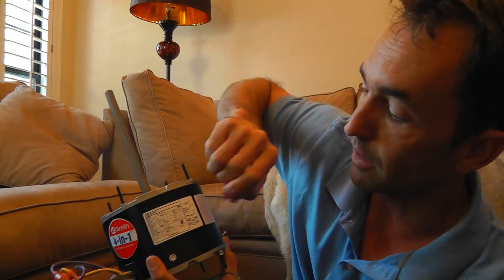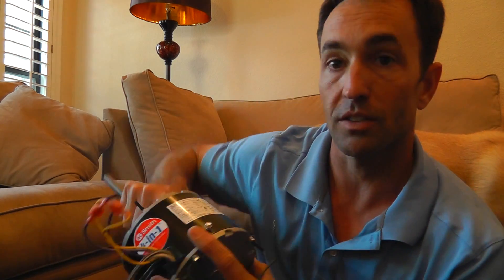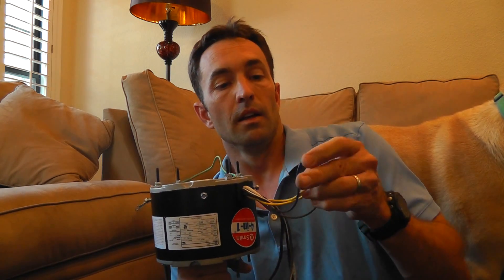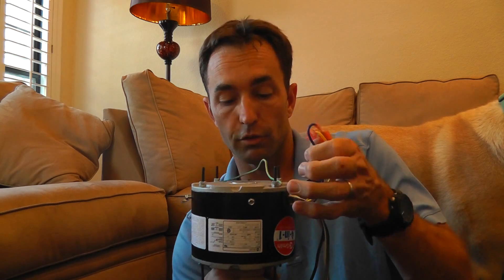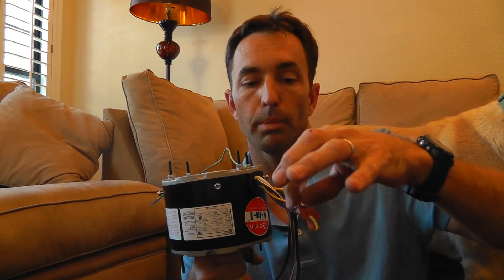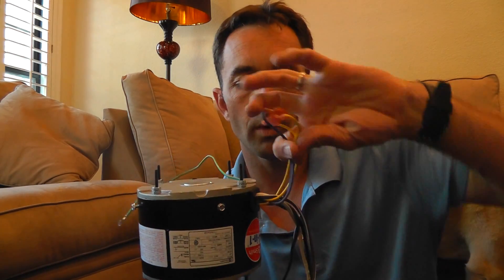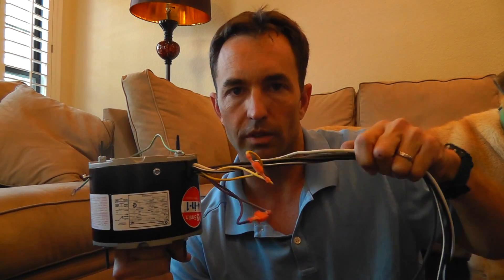So brown and brown-and-white to the separate capacitor — done. Black and white wires to line voltage — done. This last part is about rotation, about going clockwise or counterclockwise. That's referring to these wires right here, which you're going to find on a lot of replacement motors. This motor will run in both directions. What I do with these is fish them up through the barbecue grill after you've mounted your motor. If you turn your motor on and it's running the wrong way, you just pop off one of the yellows, put it to purple, purple to yellow — you're just crossing it over as shown on the schematic to reverse rotation. You don't have to go back and turn the blade. Make sure after your motor's mounted, these wires are secured inside with no slack, possibly in a little tube — anything to keep them from getting sucked up and chopped into pieces.